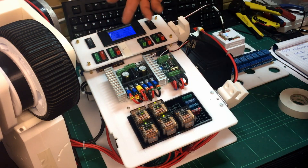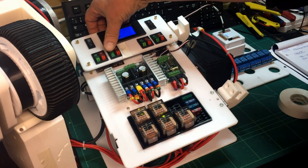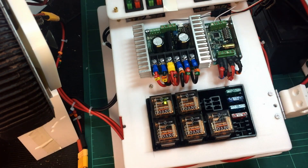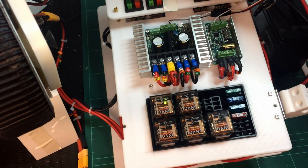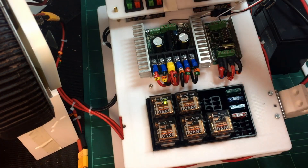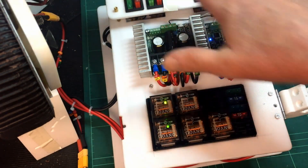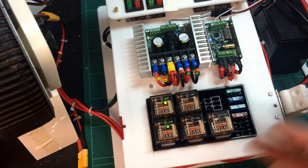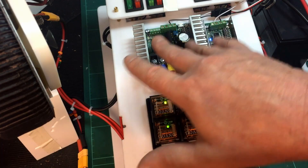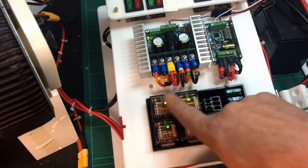I've got a master switch that's not currently used. These switches at the moment are controlling these relays here — you can see them just switch off if that gets on camera. So that's the master switch; I'll keep it on at the moment because otherwise we'll lose connection to the EZB controller and then we'll have to reload. That controls the main power coming in, then that one powers up both motors. I'm going to slightly rewire how the switches work — at the moment I've got the next two switches disconnecting the outputs of the two motors, but that's causing a slight problem, so one switch will disconnect both main motors. You can see the relays coming on in order — they're all running off 12 volts.